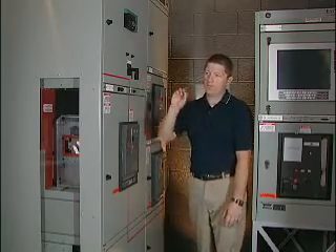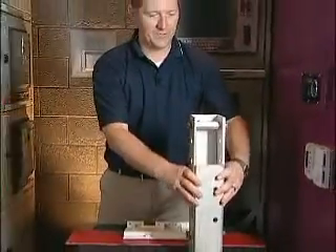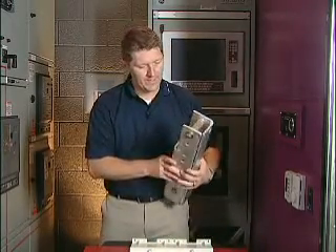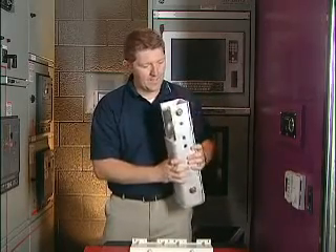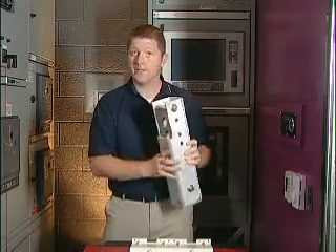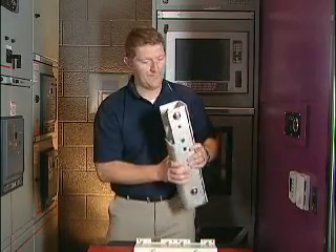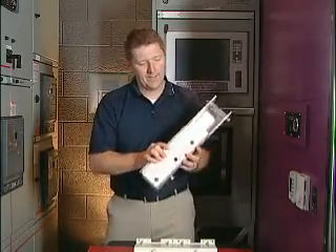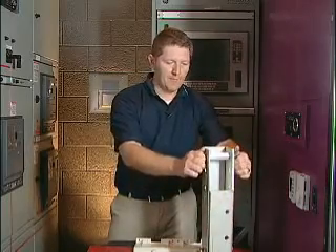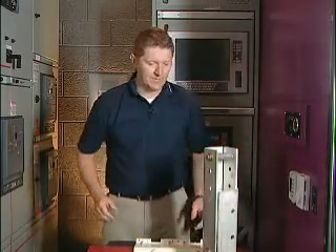That's the gist of the front of the breaker. Now I want to show you a couple of features in the rear of the compartment that are novel to this design. First, we have what we call the Miller bus — a riser bus system. Most riser bus systems are just flat bars that run up, but we made a channel so we can create basically a chimney. Air can run up through this riser and you get a double skin effect — skin effect on the inside and the outside — which increases the surface area of the conductor, in some cases doubling it. It's also a very rigid design for high short-circuit forces up to 200kA. By making it a box shape we got maximum strength and maximum efficiency in current-carrying capabilities. Our gear runs relatively cool, it's a very strong design with minimal bus supports needed.